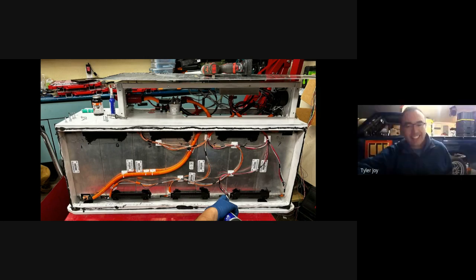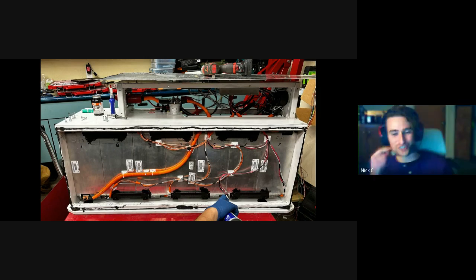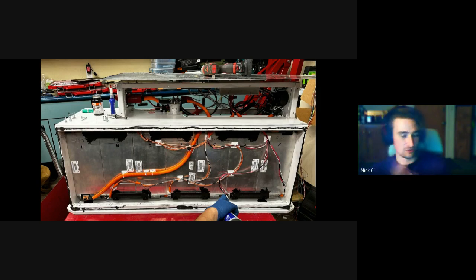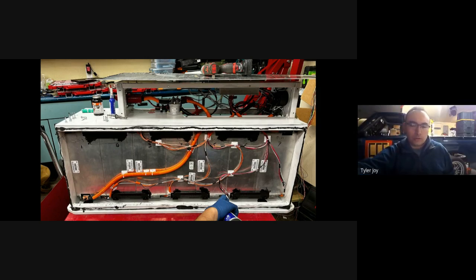Yep. And as John just pointed out in chat, Buttonwillow and Laguna Seca both have Tesla superchargers at the track, but no other track that I'm aware of has superchargers. So we really had to plan on using these RV ports, especially in Colorado for our local track. We're running a 144 volt architecture, I think that's 42S. We don't have a high enough voltage range to be using a CHAdeMO or a Tesla charger or anything like that. We basically have to do a custom charger.